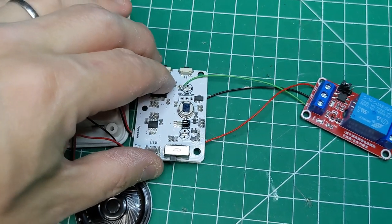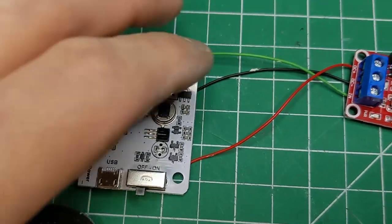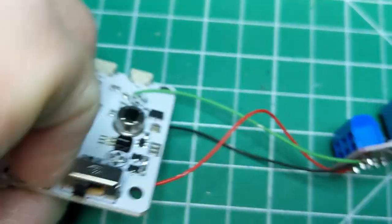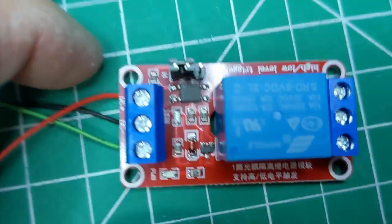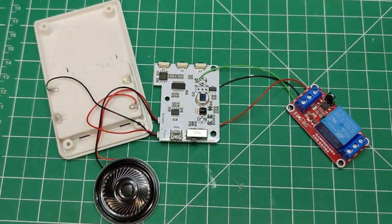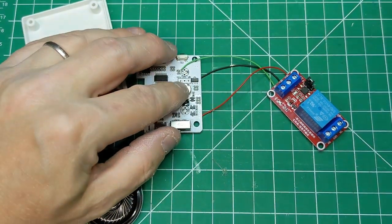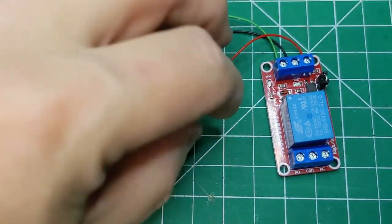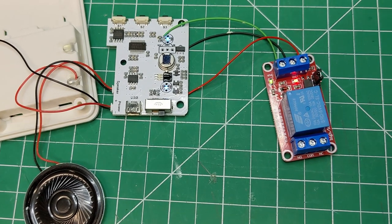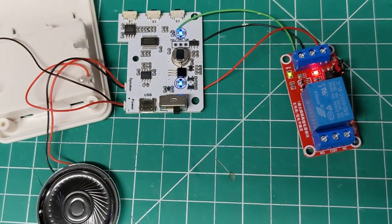We can sketch that out — it looks kind of like this. All I've done is take that wire and put it onto the input of this relay module, keeping the ground pin and the 5-volt pin from the switched output going to the relay. This relay module works active high or low; I've set it for active high. When I turn it on, the blue LEDs come on, the sound plays, and you should also hear the click of the relay. Turning off my desk light so it's easier to see — and boom, there it is, you can hear the click.